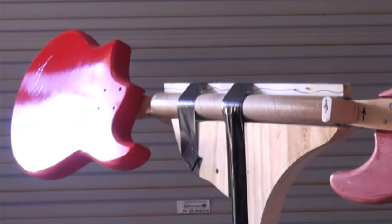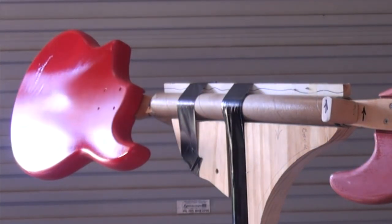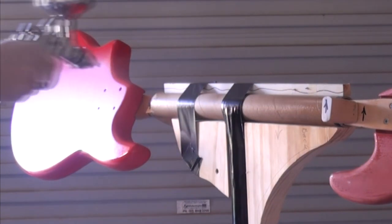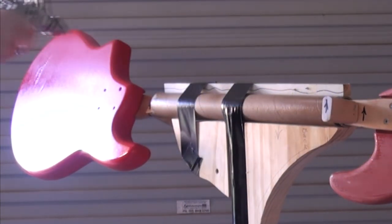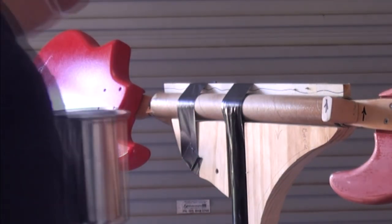I have now devised a spray routine to ensure I do not get runs in the poly or paint. Up until this point, I tried choking the material flow and just keep layering until it looked like it was about to run. Wait for 30 to 60 minutes and then go again, layering until it looked covered well enough.